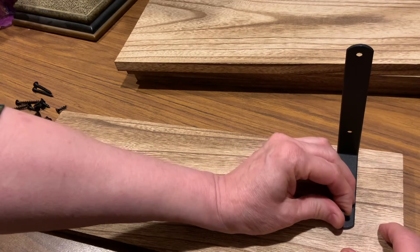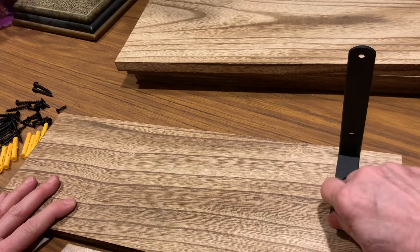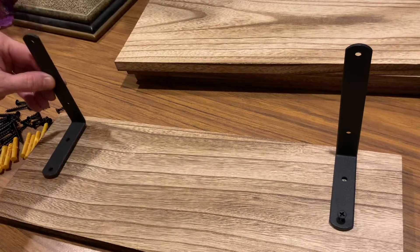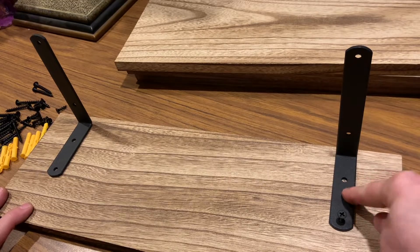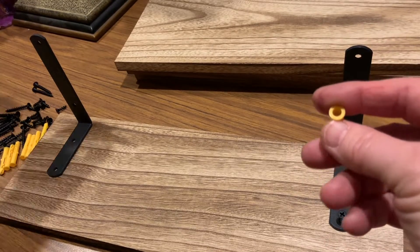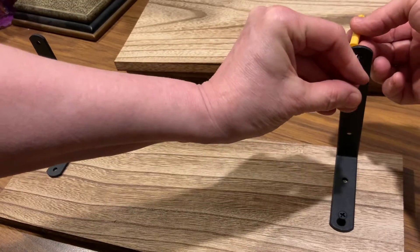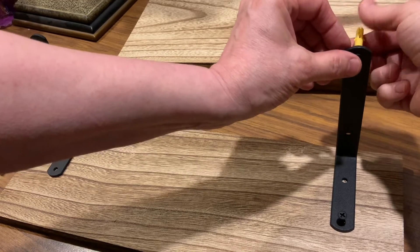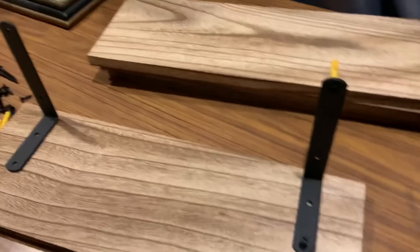I am very shocked — this wood is light enough that even just with my hands, it's already going in. So I just take a screwdriver and finish screwing it down, then do the same thing on the other side. After I get this screwed on, I take these plastic anchors and make a little hole in the wall — they just push in. Then when you take this screw and put it through like this and turn it, these open up inside the wall. That's basically how you install it — it's very easy to do.